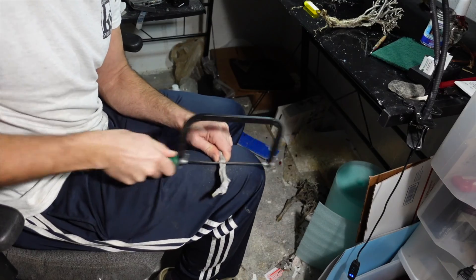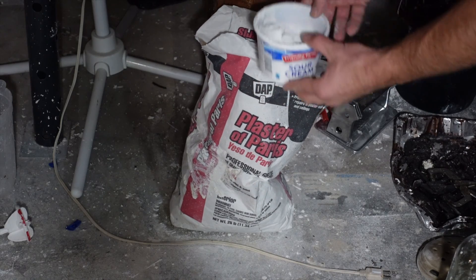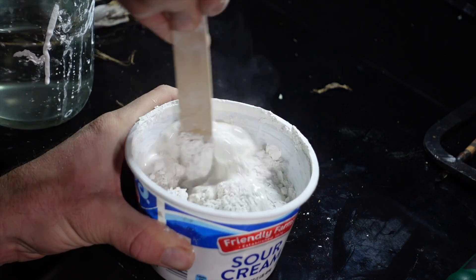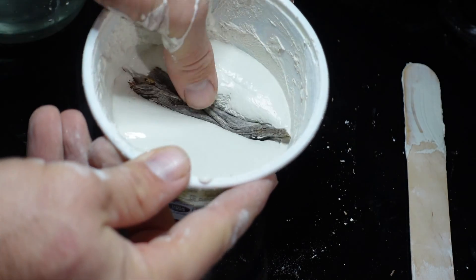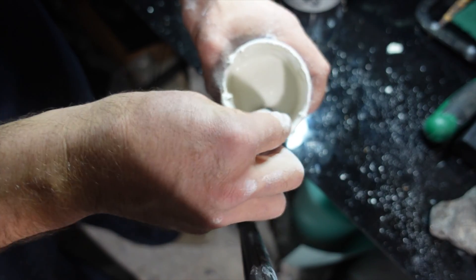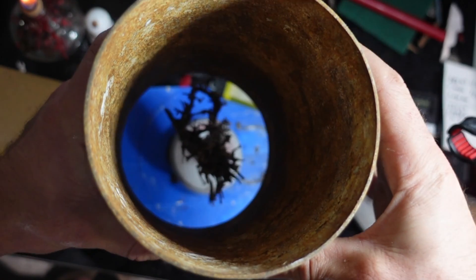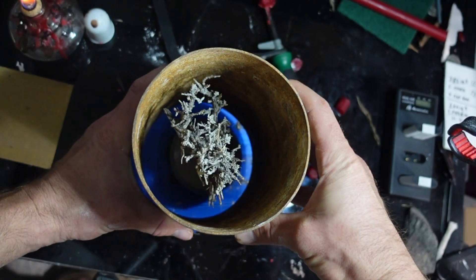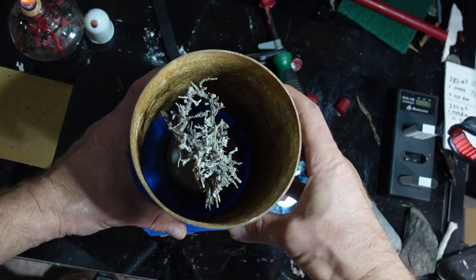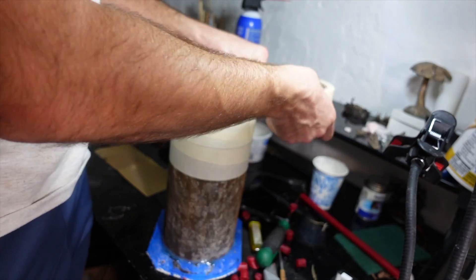I don't know how long that takes, but I need to, so I need to make some test pieces. Test pieces will help me get a better idea of how long it takes for the wood to burn away. I'm just going to put them in cheap plaster of Paris — it isn't great for casting but it'll represent the burnout rate for the sage. Then I'll get the real piece ready to put in some high quality investment, which is similar to plaster but specially formulated to handle the heat and its pores so I can use my vacuum caster.